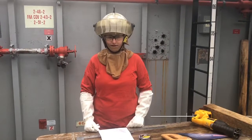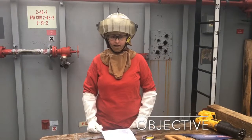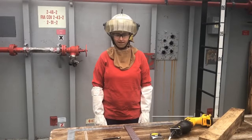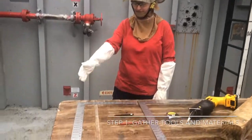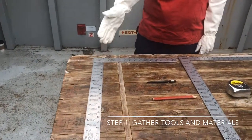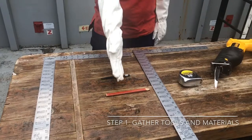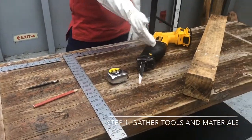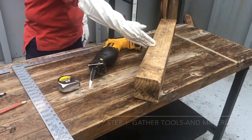The purpose of this how-to video is to show you how to construct K-type shoring using a carpenter square. Step one: gather and identify your tools — carpenter square, grease pencil, carpenter's pencil, tape measure, and saw. You will also need wood shoring and strong backs.